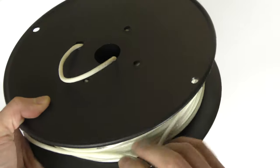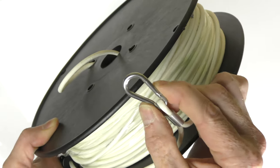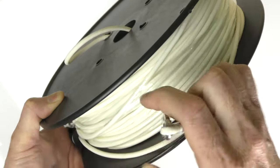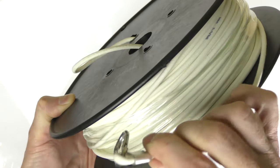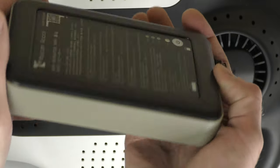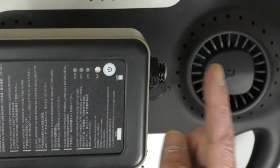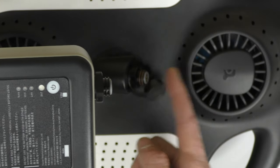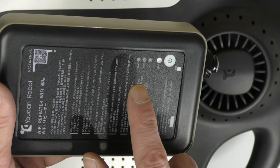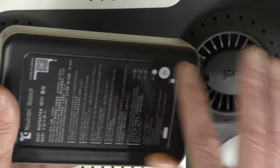You can actually attach the cable at the rear of the drone — remember that gold hook at the rear? You can attach this so that if you yank on the cable, you're not yanking on the coupling — you're only yanking on the rear of the drone to pull it back. Next, we have the Wi-Fi repeater device, which boosts the signal from the surface all the way down via the 100-meter cable. When you connect your phone, it connects to this as well as the remote controller, and everything functions.